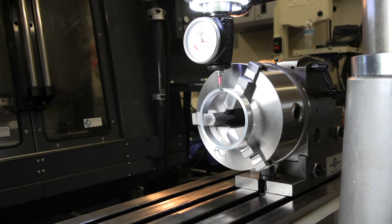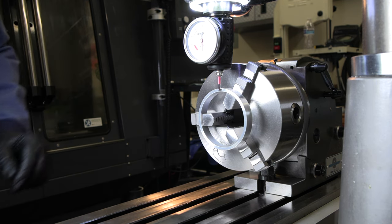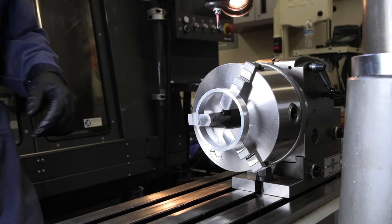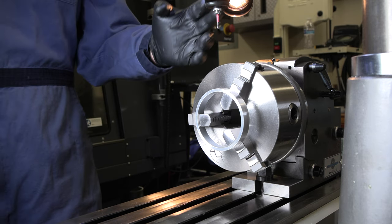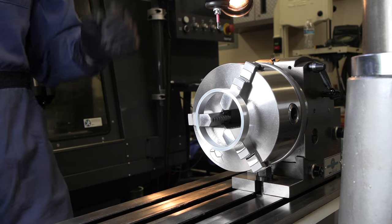Lock that in place, and now, all right, so we've zeroed our axis there. And from there, I'm gonna come over my 281 thou, and we should be locked on center for the part. Let me get my drill chuck back in there. We'll center drill it, tap size drill it, and then we'll get our tap started in there, nice and square.